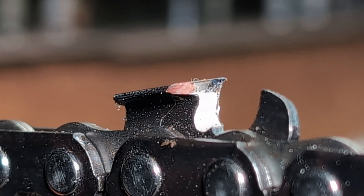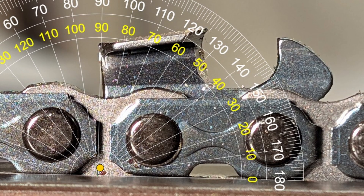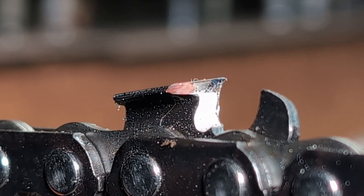That's it — that's the tilt, that's what we're doing. This is on a Stihl RS chain. If I show you pictures of an Oregon EXL, its factory grind is 70 degrees on the side plate and 60 degrees on its top plate cutting angle. If you follow Oregon's recommended sharpening specifications, you'll end up with a 60-degree side plate and a 50-degree top plate cutting angle — exactly what we have here.